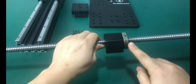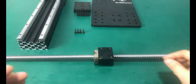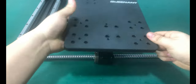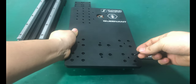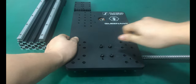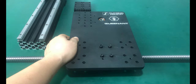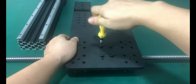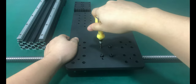Flip the screw so that the bottom of the nut housing is facing up. Attach the Y gantry plate to the nut housing with 4 M5x14mm round head screws. Use a 4mm wrench or screwdriver to tighten the screws, but do not completely tighten them. You can tighten them a little without shaking. This will be used to adjust the ball screw in the following steps.